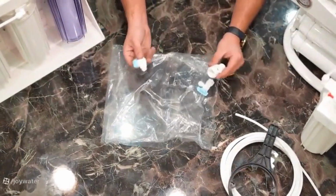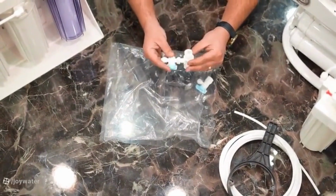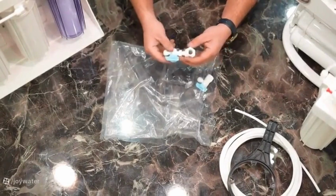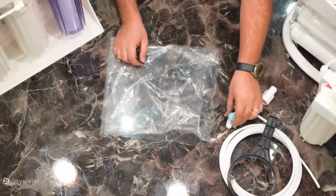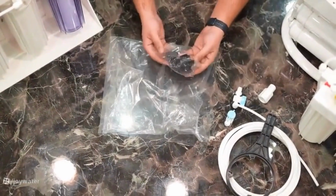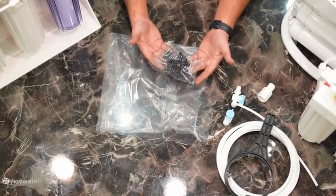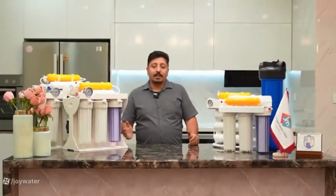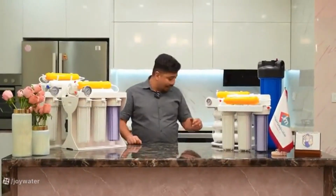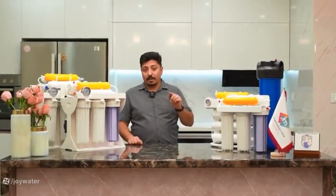It includes an inlet valve. By connecting to our inlet tee, it supplies the incoming water to the device. The tank valve on the device, and the waste pipe clamp allow you to connect the device's output or wastewater to the sewage system. Along with the device and the installation pack that has been sent to you, a tank and a sink-mounted faucet should also have been provided.